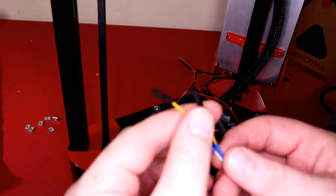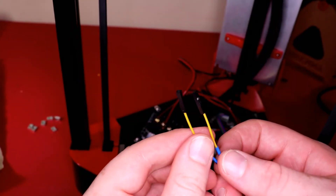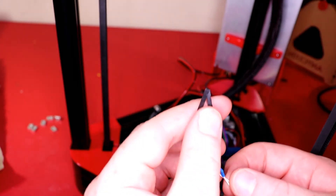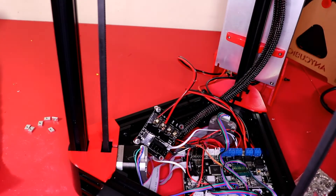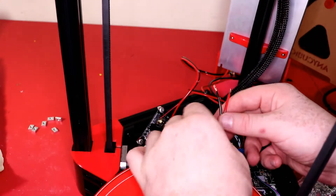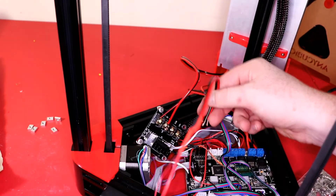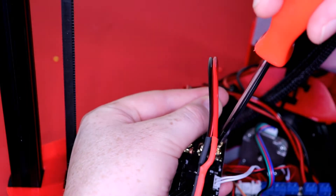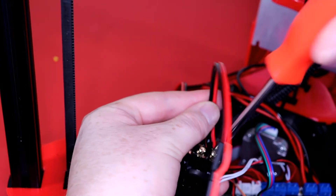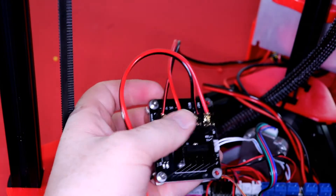The thermostat wire I cut down to a smaller length, and since I didn't have the proper crimpers for those brackets, I used wire that already had brackets on it to wire in the thermostat. Now we're going to take our heat bed wiring and put it into the MOSFET. These wires don't matter which way you put them — they go into the two slots labeled hotbed.